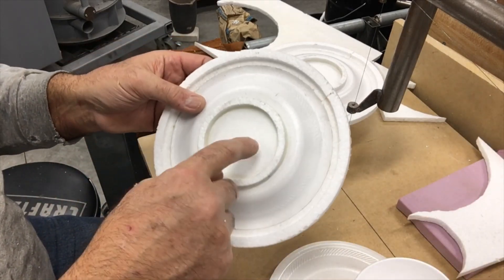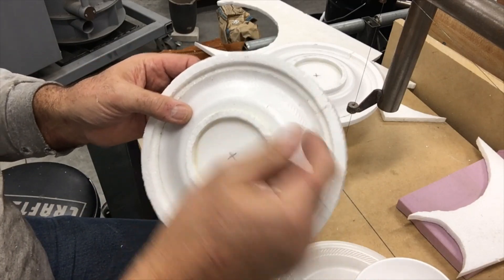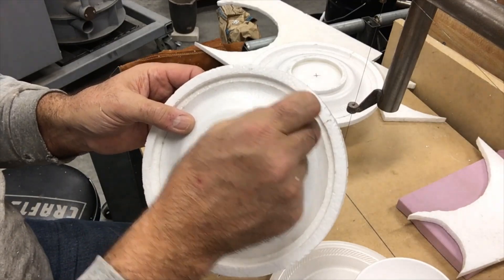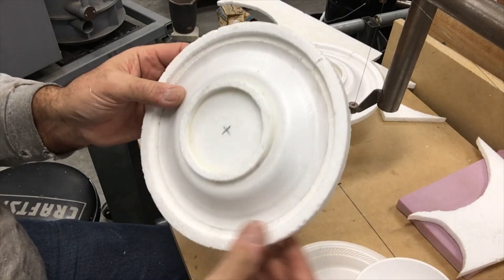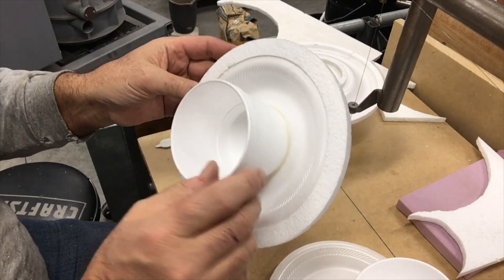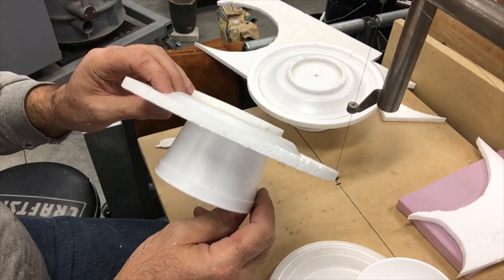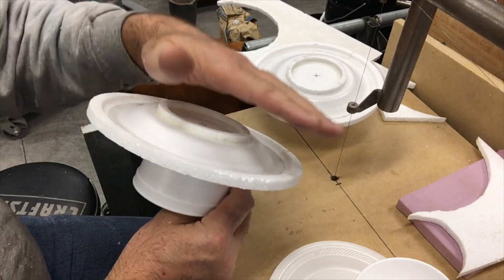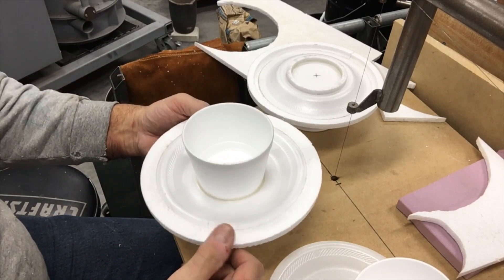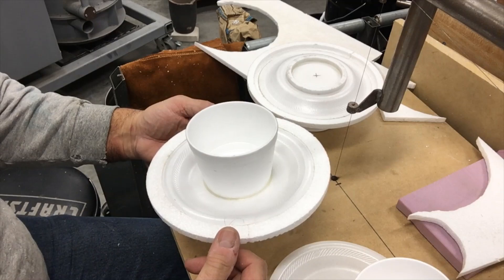I went over to my pin router, punched a hole, and just spun a circular template for that, then slit it and took a toothpick and some hot melt glue and just worked my way around, sticking it to it. We've got the ring gate stuck to it, stuck the cup to the plate, and I made this little base for it to sit on. Next comes the spruing and gating, and then I'll make the handle and the spoon last and they'll be ready.